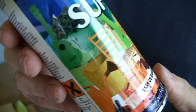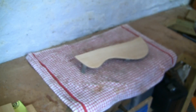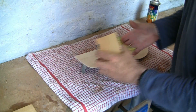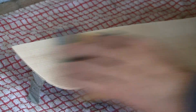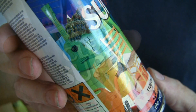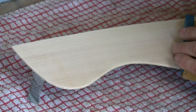Today I'm going to get around to putting a lacquer on the spruce insert, and I'm going to be environmentally correct and use a water-based acrylic lacquer. I normally use polyurethane varnish but the truth is this acrylic lacquer is also a lot quicker. I reckon I can put on about four or five coats within an hour on this hot English summer day.